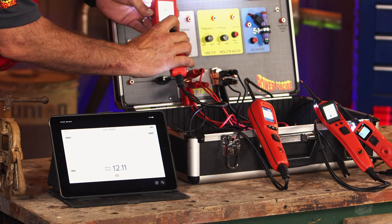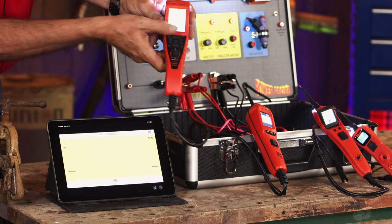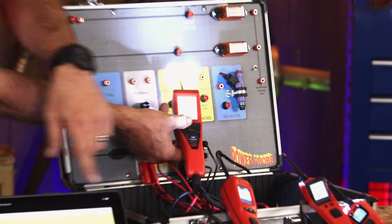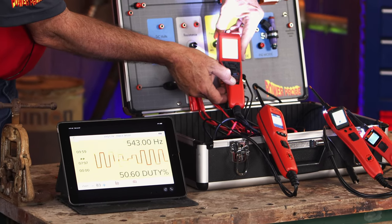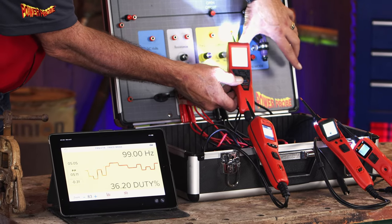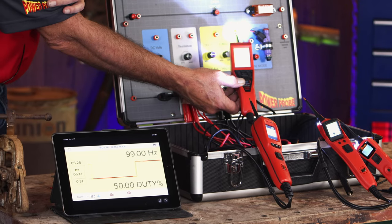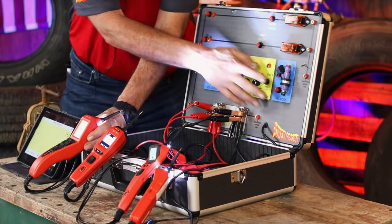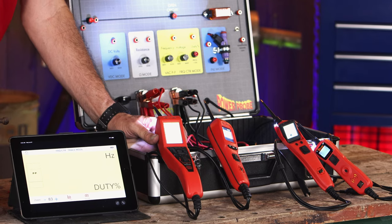The other big difference — let's go to an AC mode. Any screen where you see this arrow in the upper right-hand corner, you have two display options. I can either display the readings — frequency, duty cycle, pulse width — or if I hit the up arrow on the tool, now it's displaying the waveform right on the tool. And again, that all transfers out to the app. You can do recordings over time, do screenshots, play back your recordings later, and store them. So the biggest difference between the 4 and the Maestro: you've got all the full multimeter functions, plus Bluetooth, plus graphing right in the tool and on the app.